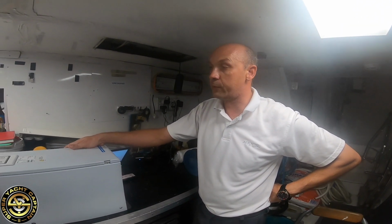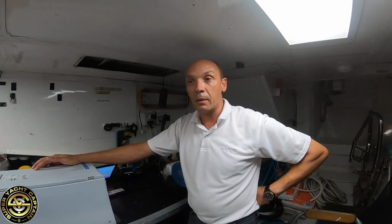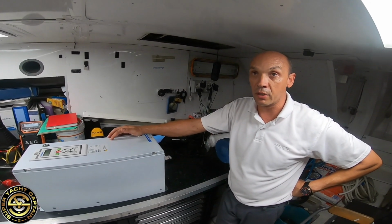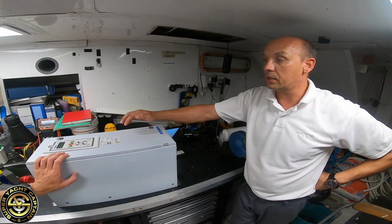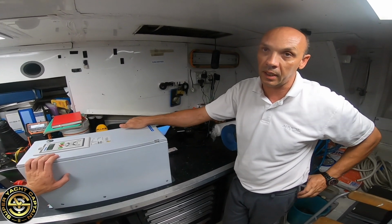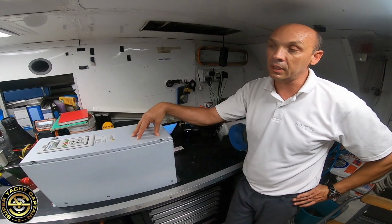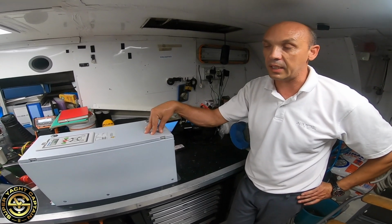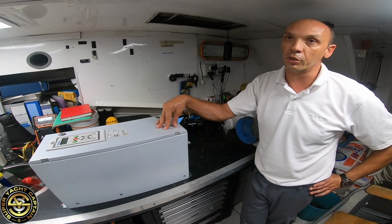control box electronics for stabilizers. According to the failure, the alarm was power failure. The code is 810 power failure. So according to this, we checked the capacitors. We checked inside the connections for the electric motor and from the main switchboard to the power. It's all okay, all connections were correct, tight, no leaks, no grounding.